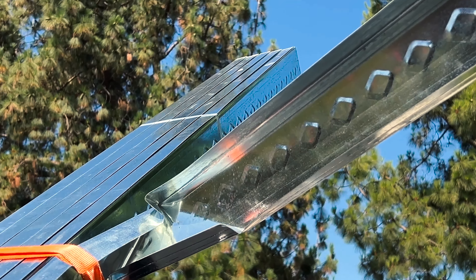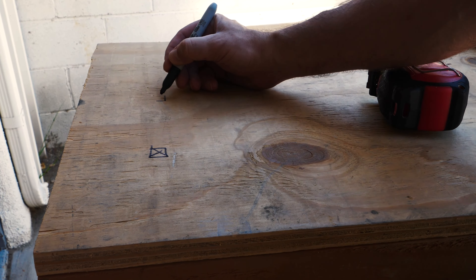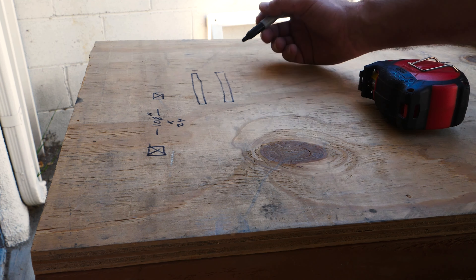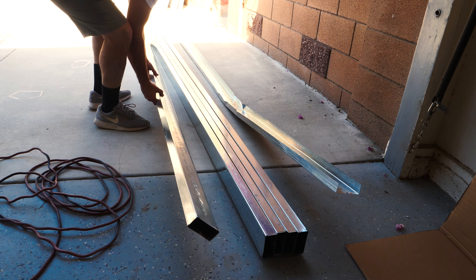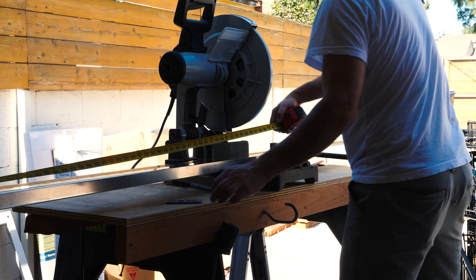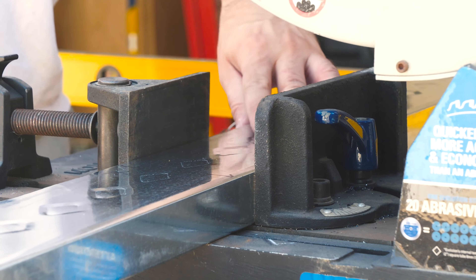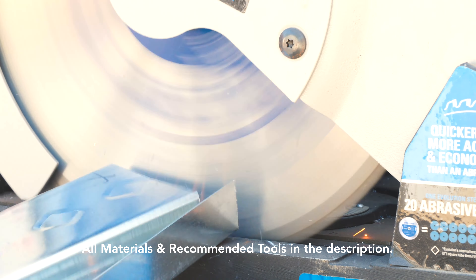We're doing the framing out of metal, and I learned how flexible metal is when I transported it for the first time. I'm a big proponent of efficiency in the shop. It's a 10 by 10 pergola, so that's what we're filling up with an L-shaped barbecue. I'm a hobbyist metalworker so I brought my metalworking tools, but the jury is out on whether you need them. Here's my first tip: get serrated tin snips. Cut both short ends and bend the studs back and forth about 10 times and it will snap with a perfect line — or you can annoy your neighbors.